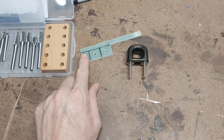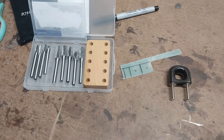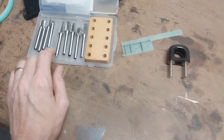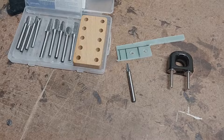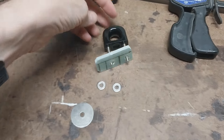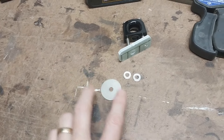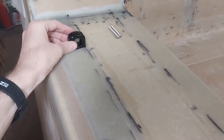I'm going to quickly make a backing plate out of some spare 5mm G10 I have for this fairlead. It's already got a couple of holes drilled in it from another project, and I just need to enlarge them a little bit. I'm so glad I have this new carbide burr set I bought — this is so useful for enlarging holes rather than the way I used to do it, which was by hand with a file. That fits now and I trimmed off the corners of it. There aren't really going to be any forces pulling it up, but I wanted more than just the tiny little washers I have, and two big washers won't fit. So easy solution — use a little scrap G10. This fairlead is going to go right here.